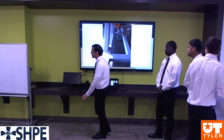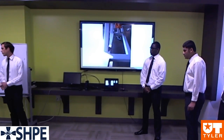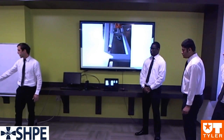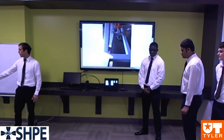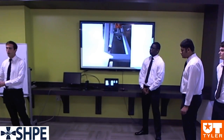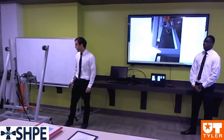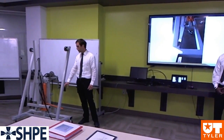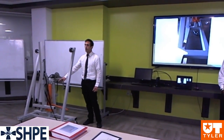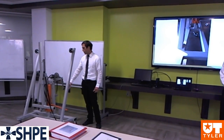As you can see from the picture shown, we added reinforcements to our main structure in the form of an angled beam on the side connecting the outer telescoping arm to the main bay, as well as members interconnecting the legs and the main base to add a safer and sturdier design. The upside to these members is that we were able to reposition our ram to the middle. So we're actually able to add an extra leg at the bottom to facilitate the ram having a sturdy position during operation.